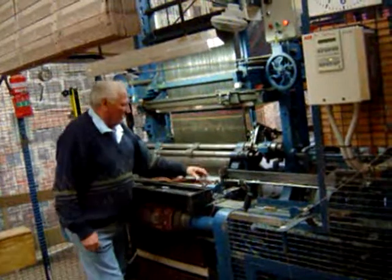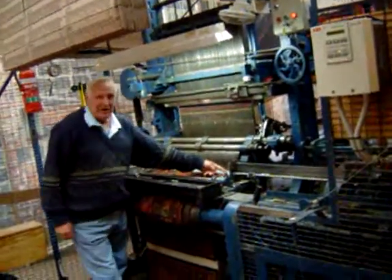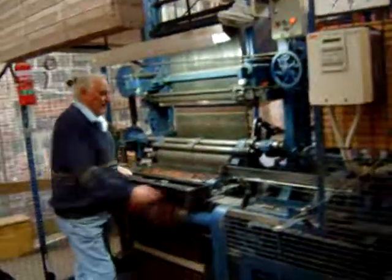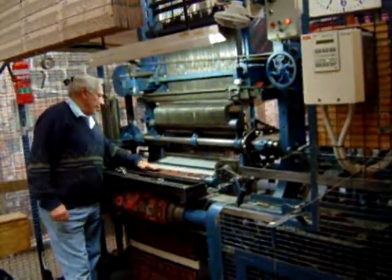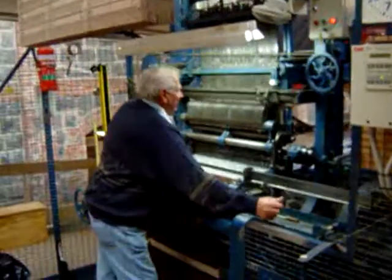Our grippers are still locked. There's the yarn still in the gripper. They won't unlock until that needle there is all the way out. They've unlocked and left the yarn behind. A double shot of jute has done his job. Another row has been woven in. So it's simply this. We lock and we cut.